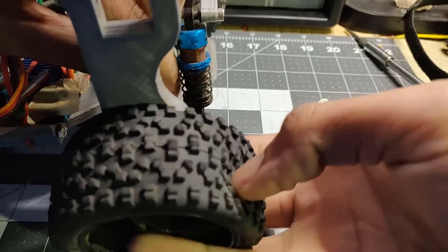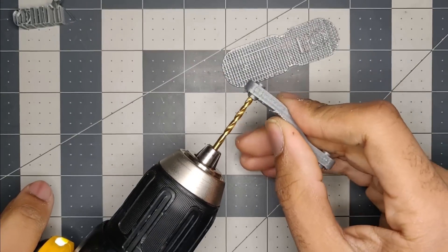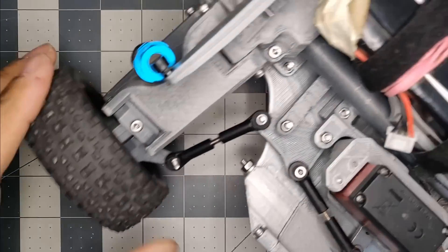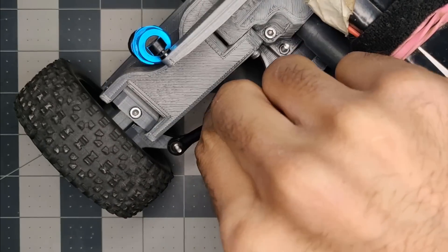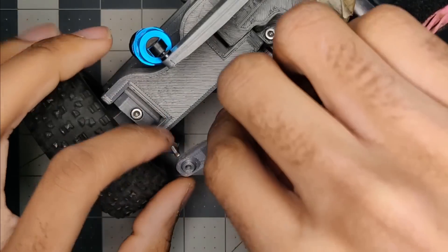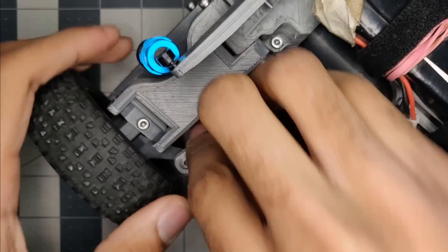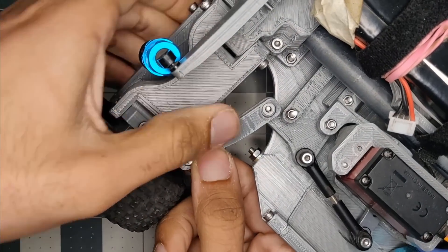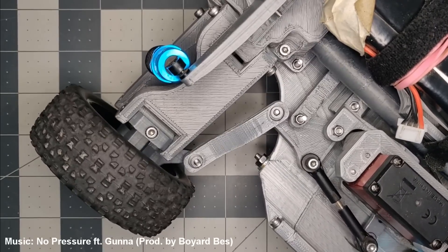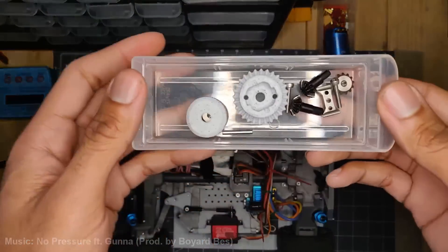You may also notice that the control arms are 3D printed. This is mainly to reduce the cost of the car, but it actually makes it more functional because the 3D printed control arms do not need to be adjusted, and you can contour them to fit the car best. My DIY 3D printer — I never thought I could print accurately enough to make something like this work, but it did. These are much easier to set up than regular tie rods with rod ends because they're printed to be the exact length you need, so you just put them on and they're right.